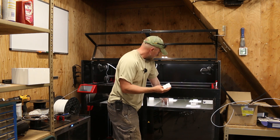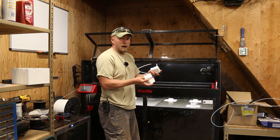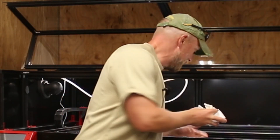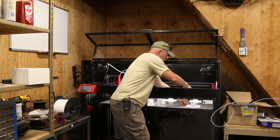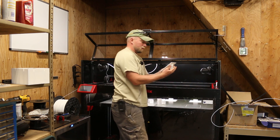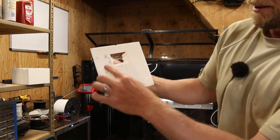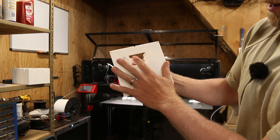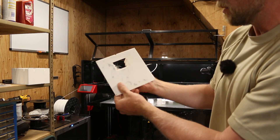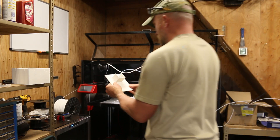I got more cartridges here. The cool thing about having the Modix printer is I can print a lot of stuff at one time — set it and forget it once you get everything dialed in. Now, that black stuff — I purged it all, but what I think happened is some of it was stuck to the side of the nozzle and it just fell off in there and I didn't catch that.